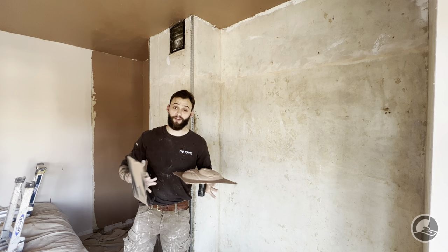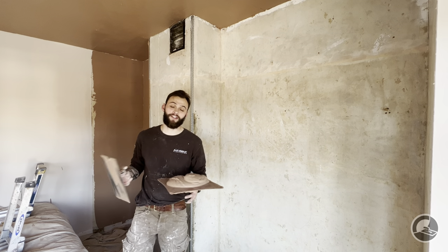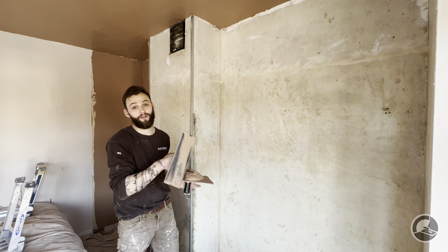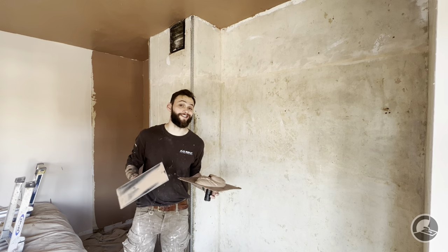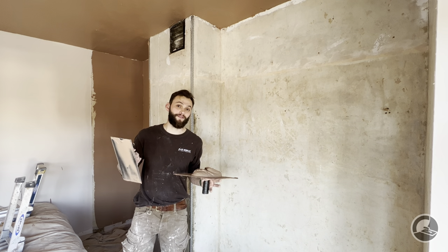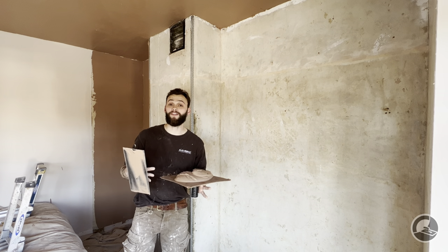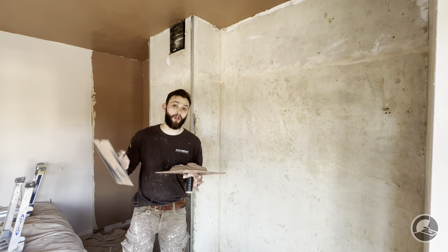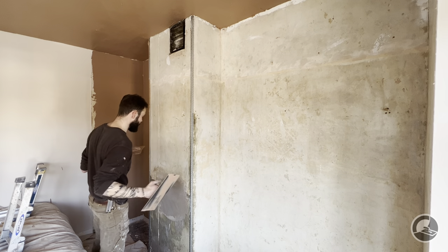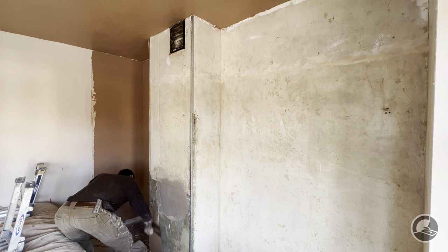When it comes to flattening the plaster, the most important thing is to actually get your first and second coat on properly - nice and neat. These are going on old plaster walls, they've been PVA'd twice, but I know this is going to dry quickly so I need to apply it very neatly. The easiest way is to apply the plaster relatively thin but with as long strokes as you possibly can. Being six foot two, I'll start right at the bottom and fill the bead out first.